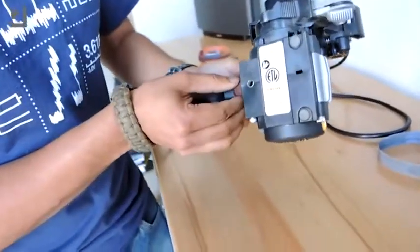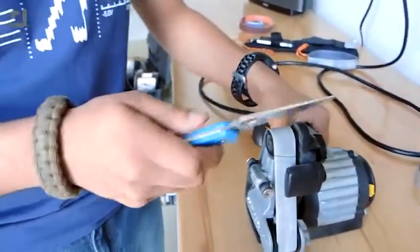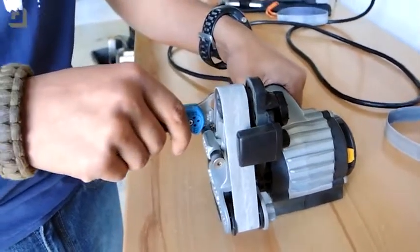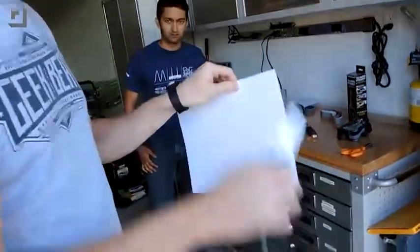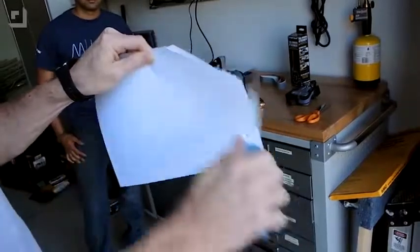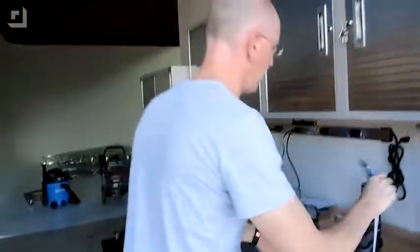I'm going to turn the speed down just a little bit — there's a speed adjustment down here. As I get finer on the belts, I like to turn the speed down so we get a more refined edge. Knife sharpening gathers a crowd — we've got people standing around to see what happened with this. Here's the standard test: we get just a little white piece of paper and see if we can slice it. Obviously, the thinner that you can make the slice, it's nice and sharp. Good job. Clearly we've demonstrated that with the normal attachment, it's possible to make really, really sharp blades using this process.